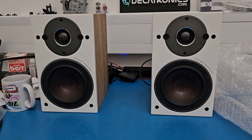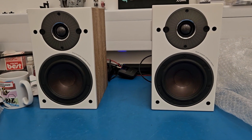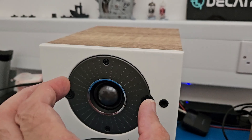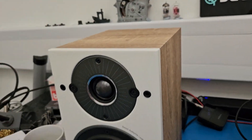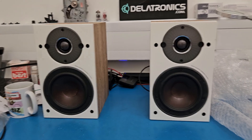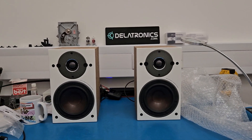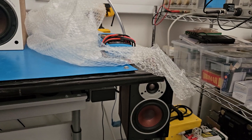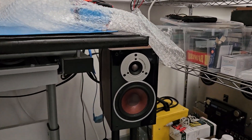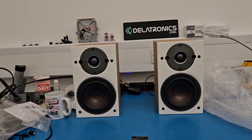I can't really fault the sound so far on these — they are excellent speakers. Dali are just superb. The Kef acoustics have a smaller woofer so I wouldn't have thought the bass was as good, and they have a very small front footprint but are extremely deep on the back, which I don't really like. Anyway, I might even take a crossover out of one of these and put it into the other to see what it sounds like. The crossover on the Zensor is 2500 Hz and on this one is 2800 Hz, so there's not much difference there.